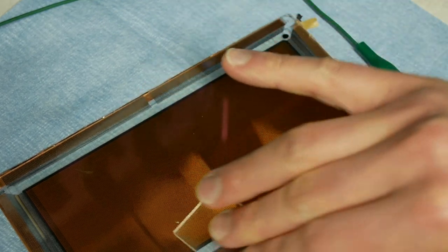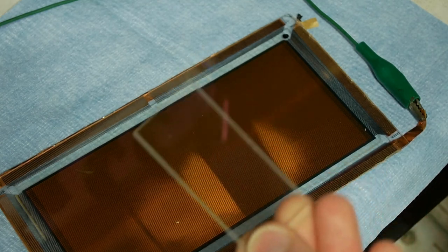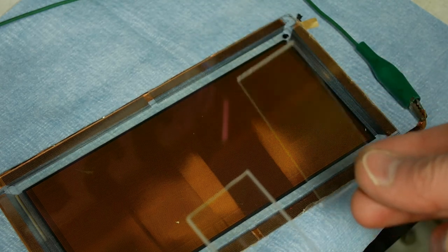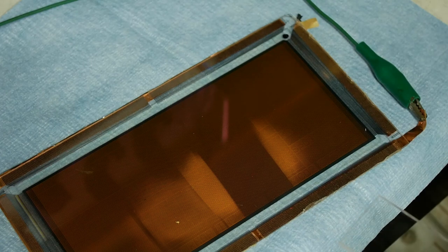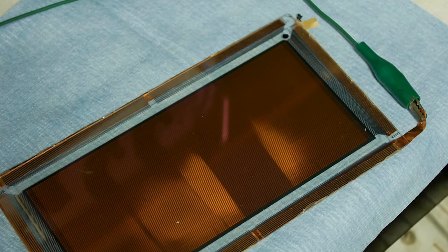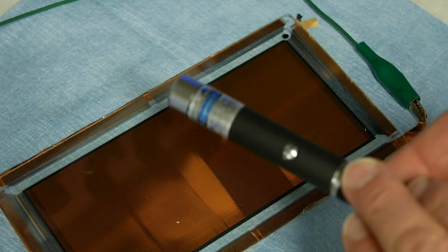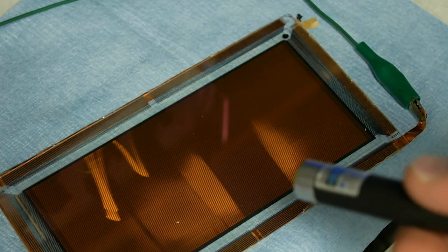Let's see what we got. One of these — I think this is polymethyl methacrylate, or acrylic — passes the ultraviolet, or at least 365nm light, more willingly than the polycarbonate, which blocks a lot of 365nm. So you end up with this pattern — you can see between the two pieces of plastic it was even brighter, because even the acrylic blocks some amount of UV. This drives home that this thing is very wavelength sensitive. Even though the laser pointer is specced at 405nm, they aren't perfectly narrow, and there is some amount of 365nm light coming out. It's so intense that even the long tail still has quite a bit of energy in it.